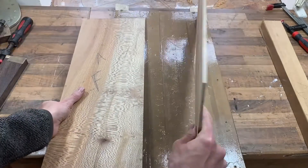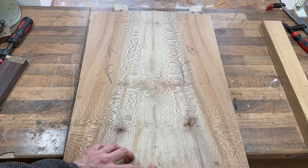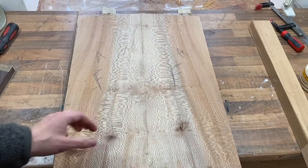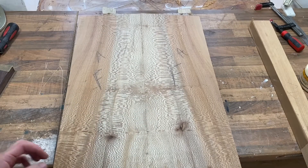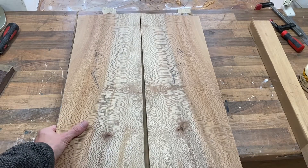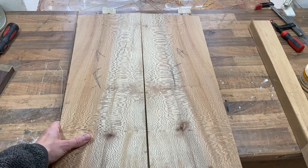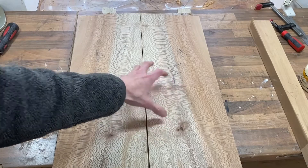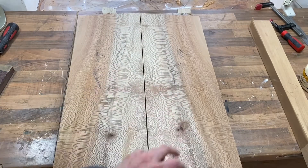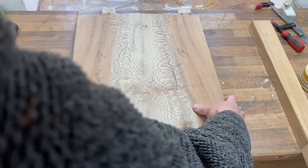The idea is the top set will go on here. We'll have a couple of clamps down here and a couple of clamps up there, both clamping it down to the MDF to keep everything flat. What you really don't want is a gap underneath, because you'll end up losing a lot of material when you come to thicknessing, and you'll also lose the bookmatch — because if you sand one side more than the other, you'll end up with a different pattern and the bookmatch will be lost. So it's important to keep everything level.